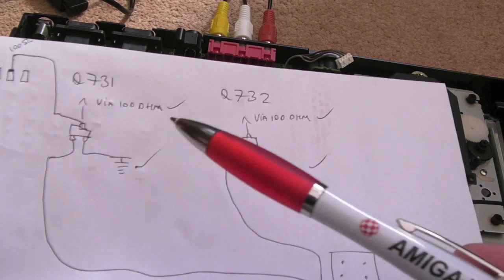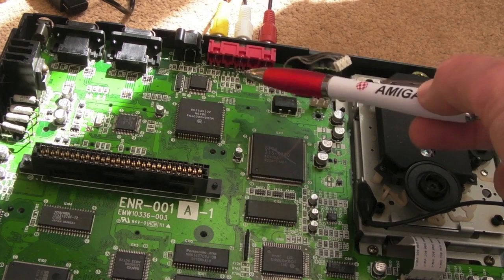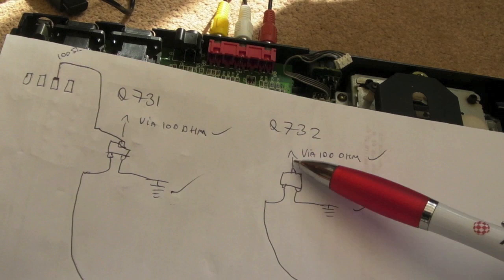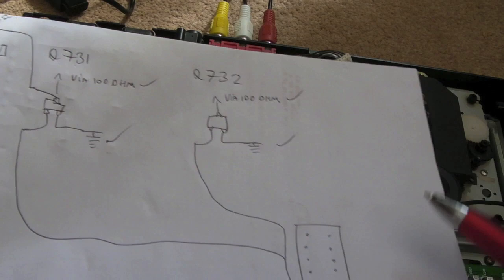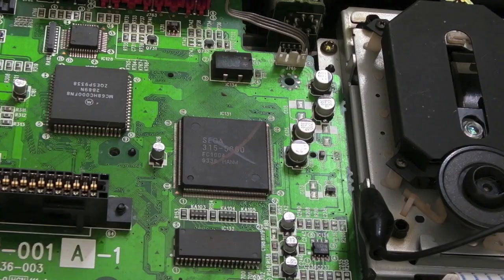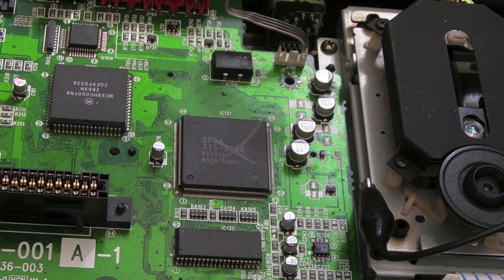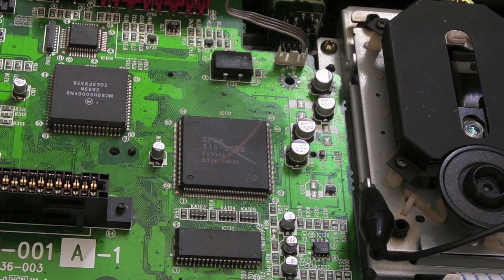I followed the signals from the left and right hand pins of that three-pin device to the areas here. When you see two identically laid out areas of the board, you know it's going to be left channel and right channel. There are two transistors here — the left-hand pins of those two transistors join together and come down to a pin on the little white connector that goes to the audio PCB. I was theorising that's probably the mute signal. I traced signals from the 5660 chip — which has the sound from the Mega Drive side — and the inputs go into an op-amp here, with the outputs coming through coupling caps, and into a second op-amp. Scoping them, I could see the signals no problem.